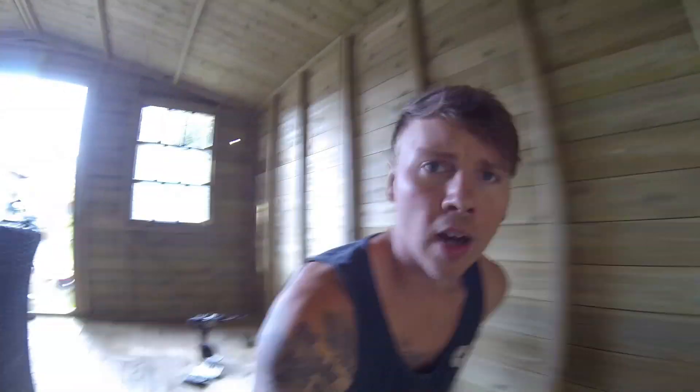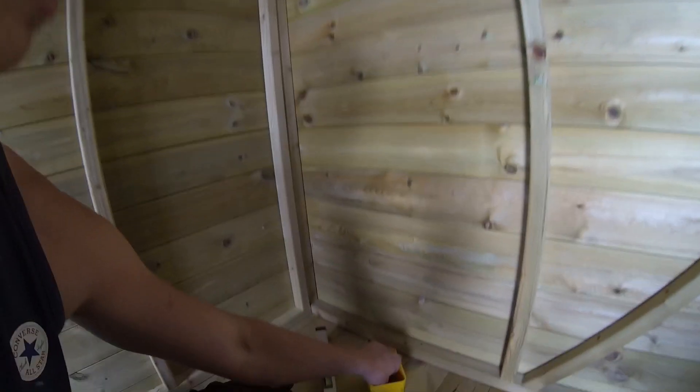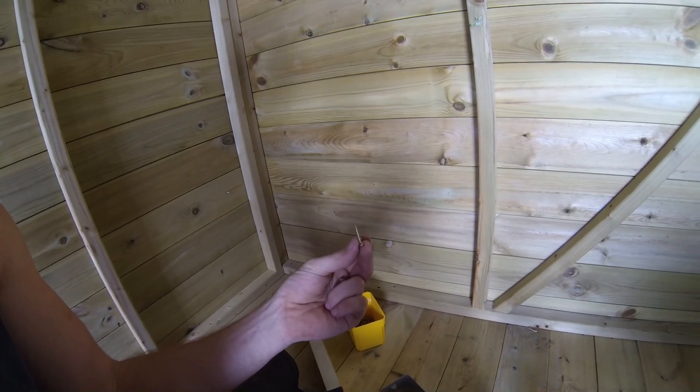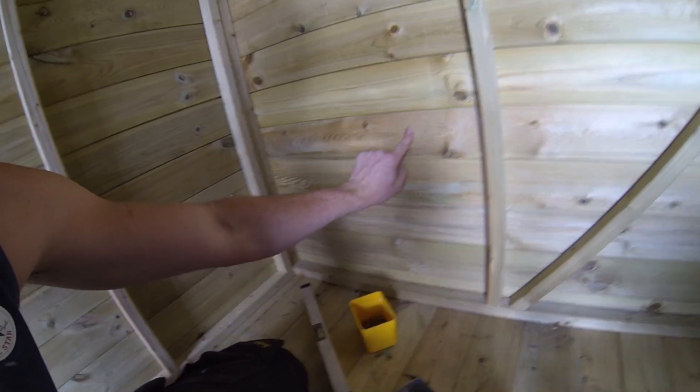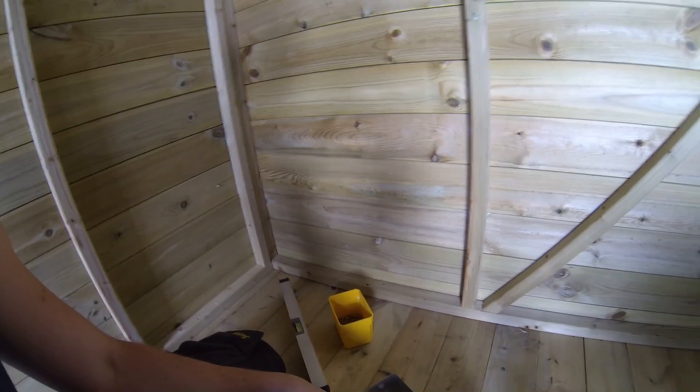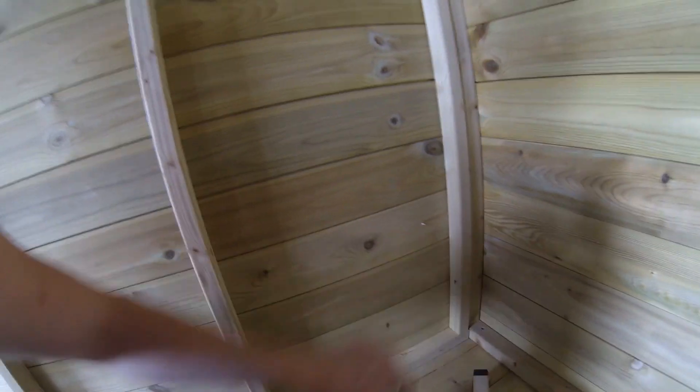The IP rated socket is going on the inside too — gland in the bottom, drill straight through to the socket for a nice clean connection. I'll get everything mapped out and pencil marked. I've got a few things screwed on: fuse spur up there, holes drilled, light switches on. I've run out of my smallest screws so I'm using washers to stop them going through — the wood is slightly too thin.